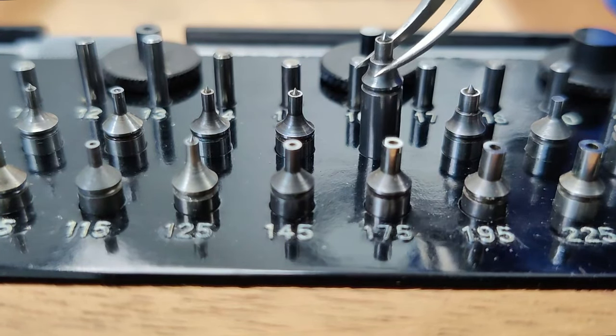And the problem is that there were too many timing washers on the meantime screws, and these washers add weight to the balance wheel, thus slowing the wheel down. When I removed them all, the watch ran too fast, gaining about 120 seconds a day. We can correct this by using properly calibrated timing washers and this funky screwdriver that looks like something out of a nightmare or the Alien movie.